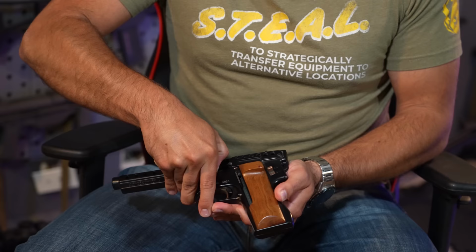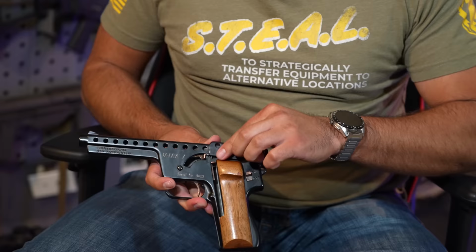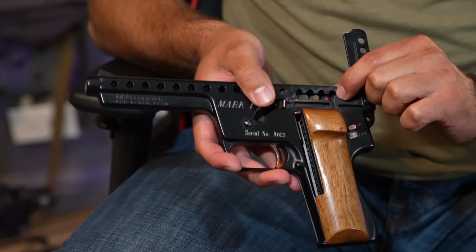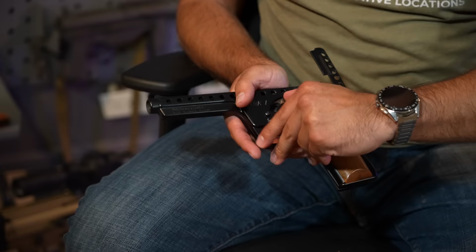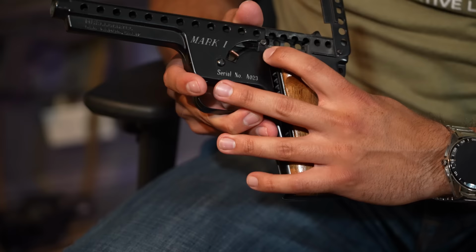Our hammer is internal, so you see this right here? Instead of being in the rear, the hammer is in the front, and it's set like so, so that when you fire it, it releases and pushes forward on the projectile, which, push up our loading gate here, it actually pushes the projectile backward onto the firing pin, which is recessed back in here. So that strikes the primer, ignites the rockets, and it pushes it out, which then resets the hammer. This here is actually the follower, and this little tab here is how you can load the magazine in the body of the handle, like so.